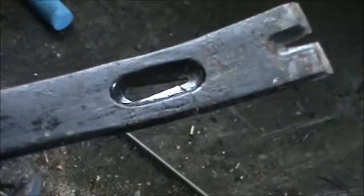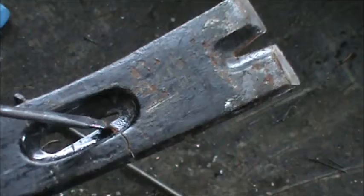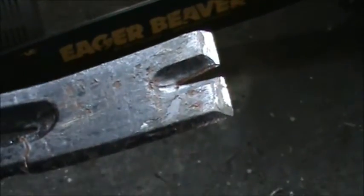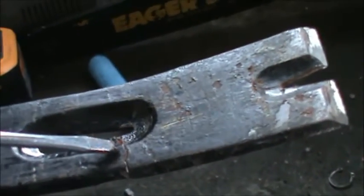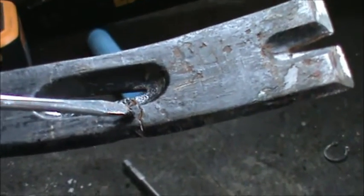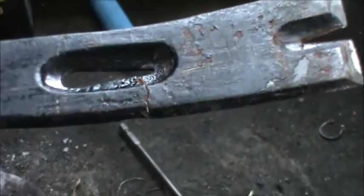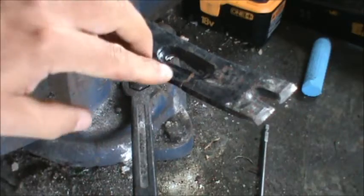Here I've got a little crowbar up in the vise — it has a crack here. What we're going to do is repair this, make a weld. This thing's about 3/16ths of an inch thick. We're just going to grind it, clean it up, weld it, and hopefully the crack won't be there. By grinding away some material here, it's going to set it up so that we can fill it in with a weld.